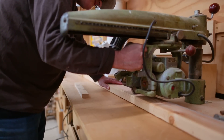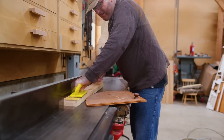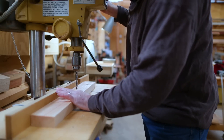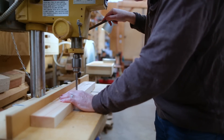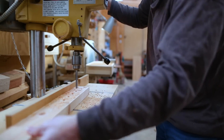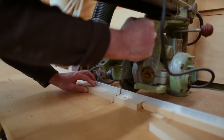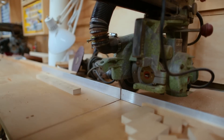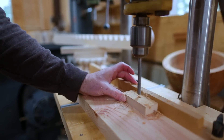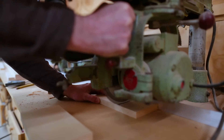Now I wanted to start coming up with ways of holding things to the table. For now I wanted to make some kind of beam that would clamp a much thicker object to the table, like a bowl. I came up with a bunch of different ways and even half-built a few of them, but what I ended up with was to just use threaded rod and a beam. I can hold the threaded rod to the table by sandwiching the table between two scrap pieces of wood. Then I needed to cut my threaded rod to the right length.